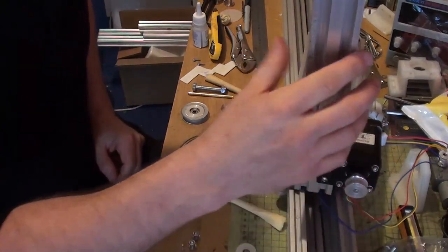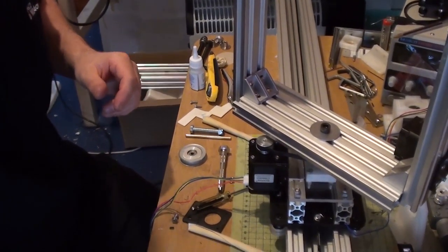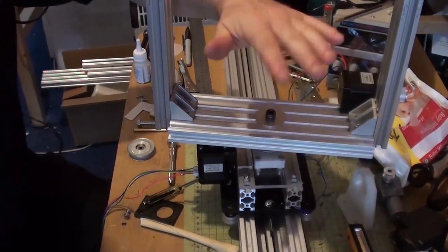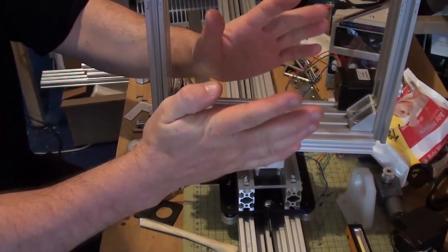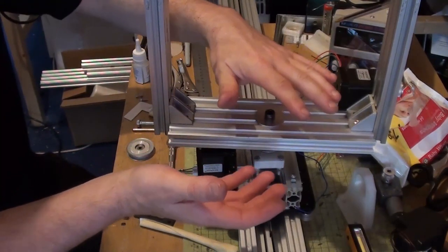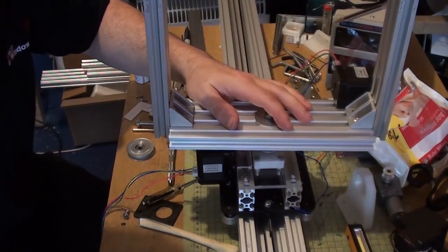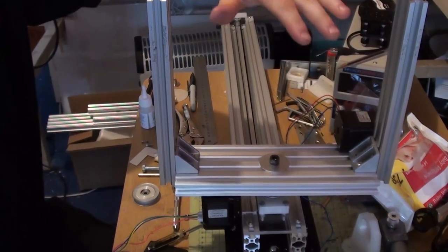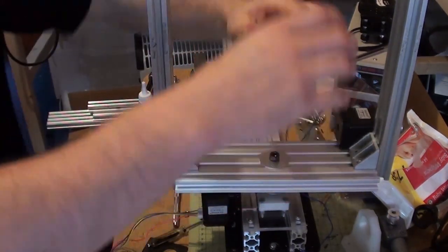Now, the other thing to remember here is that I've built this, let me just see if I can come up a little bit wider. Let's lift this up a little bit, there we go. So I've built this, and it's quite a large rig here, and there's a lot of space here for movement. There has to be, because of the camera that's going to be sitting on here. It's not just the camera body, but the lens that sticks out in front. If you make this too low, then the camera has the option of tilting down and having the lens smack into this bar. That's an expensive amount of glass. You don't want that to happen. So the camera is actually going to sit much higher up, so that when it tilts, it can swing right under. That's what we want, to make sure the camera has clearance.